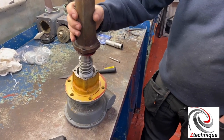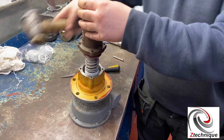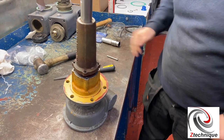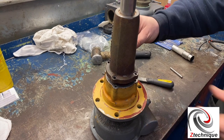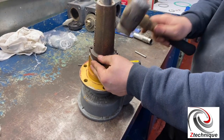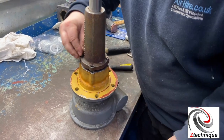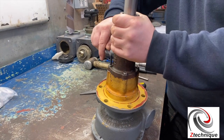We're just going to enter this down now onto the shaft through the bush — it should be just a fairly smooth fit. Now we're going to put the four screws in. That seats down into the bottom, and then what we're going to do is pull it back down completely against the spring tension with the four screws. We're just tightening the four screws now, just nipping them down.